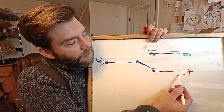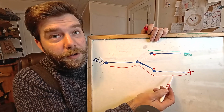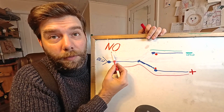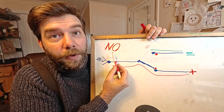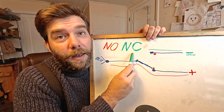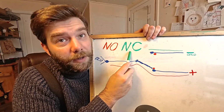And that is connecting our input pin on the Arduino to 5 volts, and that will be a 1. So that's what it means when you see the NO marked on the body of the switch. That's the normally open contact, the one that will not conduct electricity through when the button is not pushed. Another pin that you'll see is marked NC. That is the normally closed pin. This pin will conduct through when the switch is not depressed.